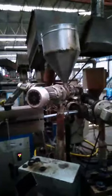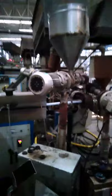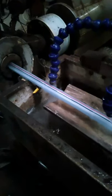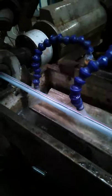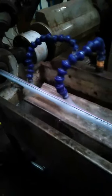And this, you can see these two little extruders. The two little extruders are for the line. We just see the red and blue line for the mark line. You can see here, they are shaped here. When it goes out to the second mold, the fiber is finally shaped. This spray water will help the hose shape better.